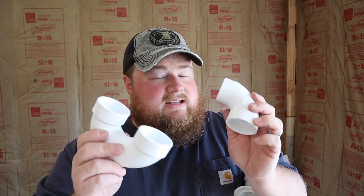In all reality we want to make sure we show you guys a lot of things that go into these projects so that if you decide to do it yourself you're better prepared. We would be doing no one a service by glazing over or making something seem easier than it really is. I have debated whether to bring the camera under the house, but it's just going to be too much to juggle for what is effectively a couple of PVC pipes I'll be gluing together. We're going to take the bottom of the tub drain and glue on this P-trap — this is a Schedule 40 trap, same recommendation as the tub kit: get the more expensive, thicker stuff.